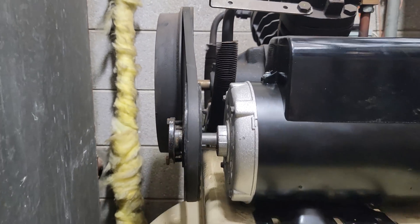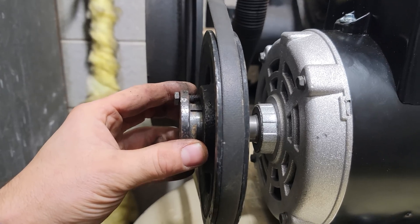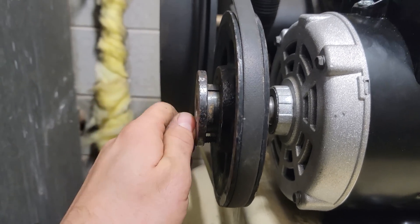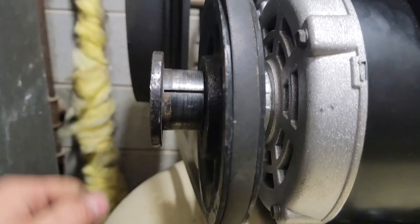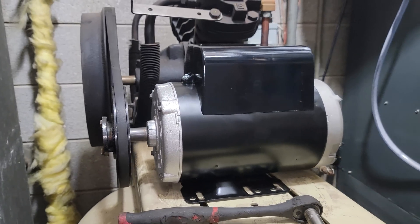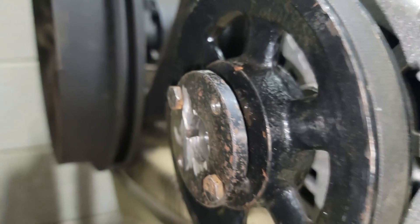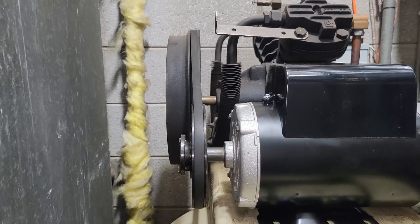The pulley alignment is a little off. Our mounting points are where they need to be, but we'll need to pull the pulley up or adjust the motor position to get alignment right. We may need to pull the pulley piece off slightly to get the full distance we need. Once we pull the pulley further onto the shaft, that small gap should give us the alignment we need, and the bolt holes are lined up.